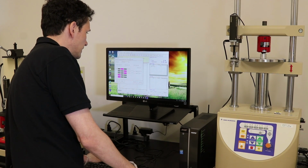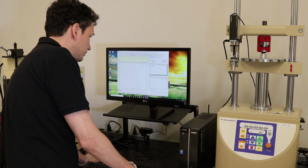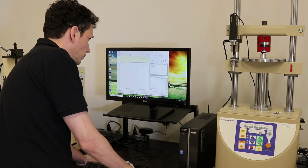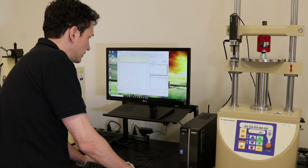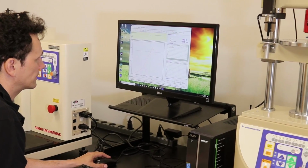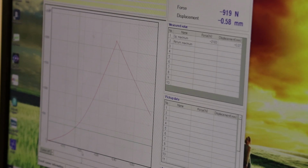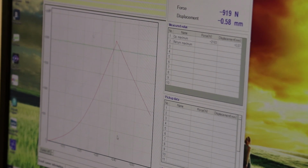So we give the customers basically a stress strain curve at a specific speed, and then what we'll do is we'll actually wait 1 minute, and then you get this force here at 1 minute. So basically, it gives you the dynamic forces that you're dealing with, and then the static load, the pseudo-static load, you're going to see. I call it pseudo because it actually does change a little bit over time.